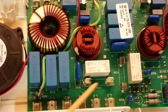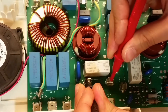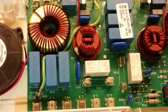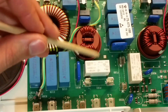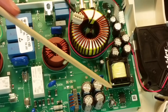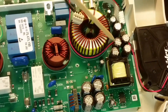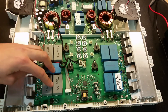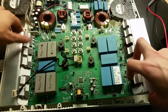Let's have a look from this side where the mains connector is. These empty fuse holders actually look like they are shorted together - let me measure that. Yes, they beep - so they are shorted together. So L2 is connected to this one, L1 to that one. There are relays here. The power supply has what looks like fusible resistors, an interference inductor, capacitors, a control drive chip, a transformer, an optocoupler, and smoothing capacitors on the output - should be 5 volts and 12 volts.